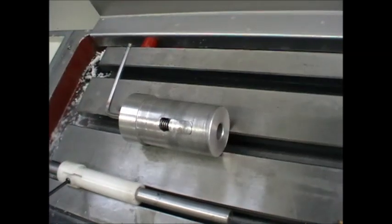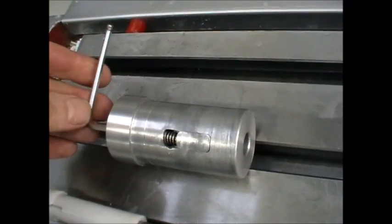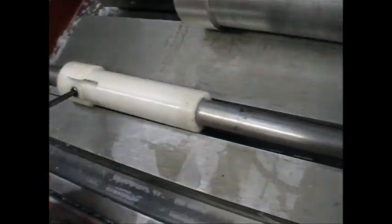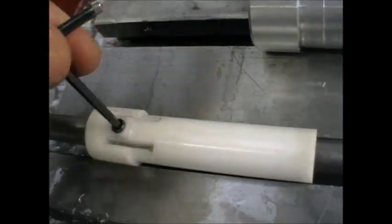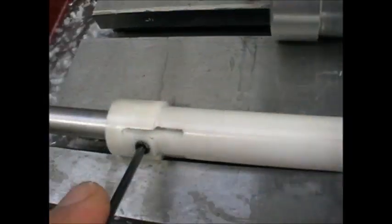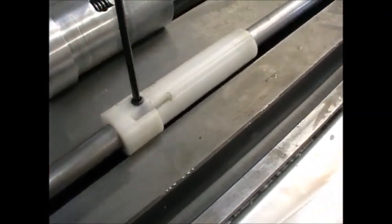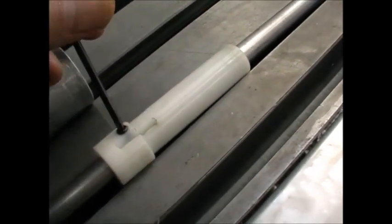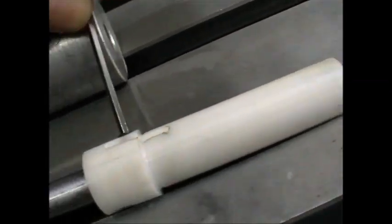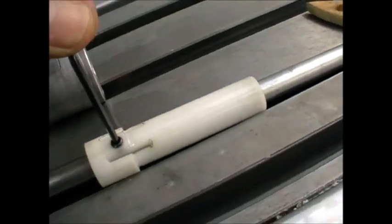Just on the subject of a spindle stop bush — here it is all dismantled. The one I've got, which I removed from the super spacer, is the same one I also use on my lathe — a sort of mark-one version. But there's an even easier way of making it that occurred to me afterwards, and I've used this on my dividing head. It's just a piece of acetal — though you could use aluminium — with a couple of slots cut through it and one grub screw. That one grub screw tightens on the sliding shaft through the middle, and after doing that it swells the diameter, locking it on the inside of the bore.